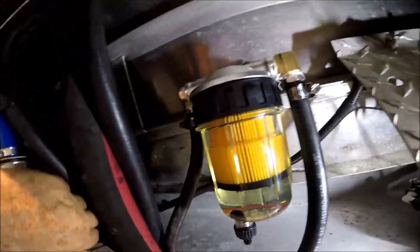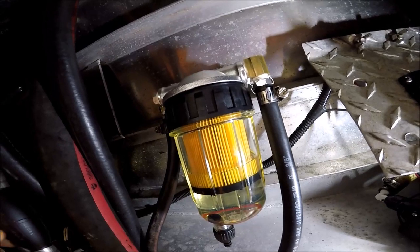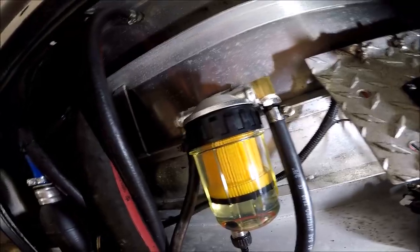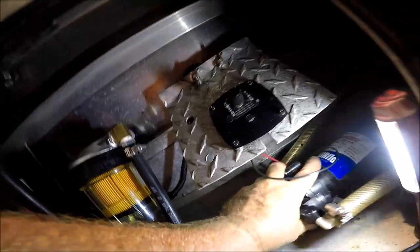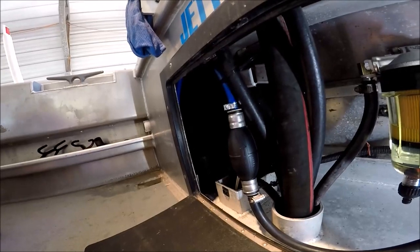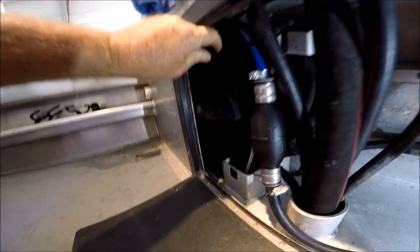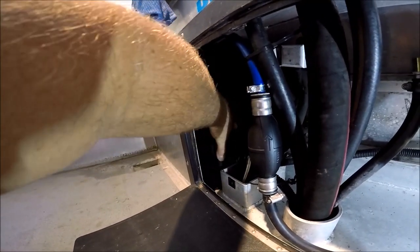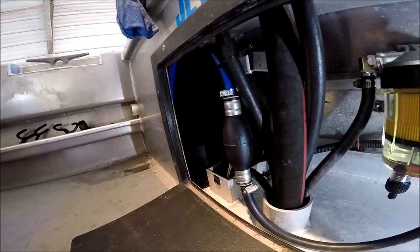There she is, she's filling up. This is my little back hatch: live well timer, live well, and wash down pump - it just sits on rubber feet, I don't even have it bolted down. Here are all my fuel lines, and back here I carry a big Mister Funnel that actually separates water from fuel. It separates water from fuel down to about 10 micron, just like this filter. I did a video on that a long time ago.